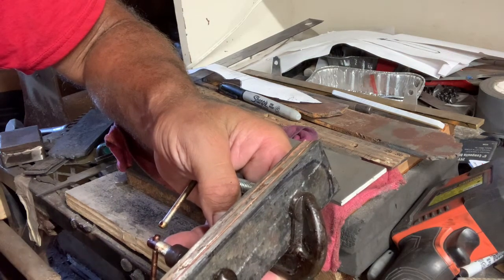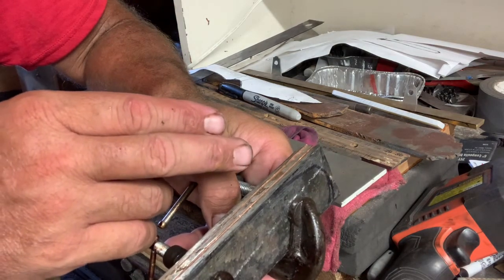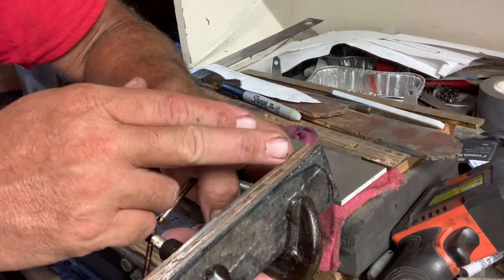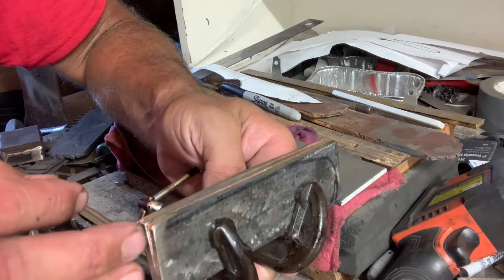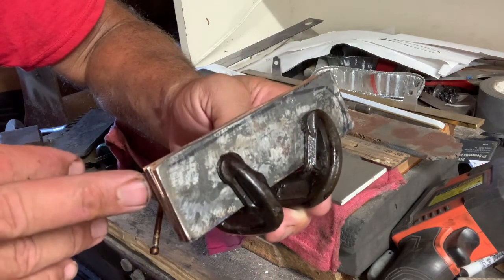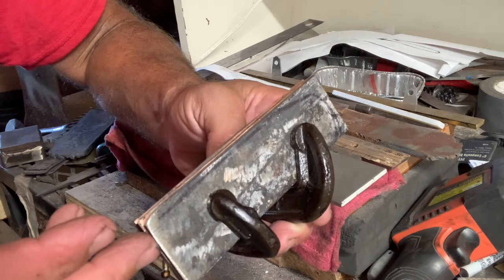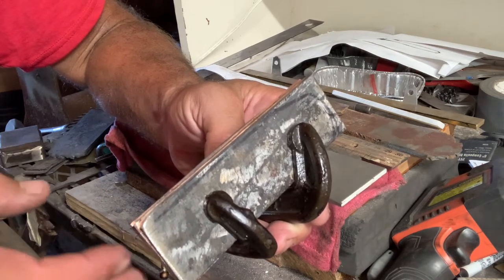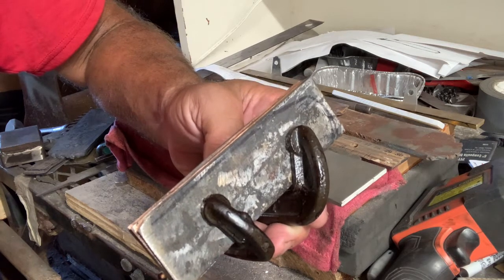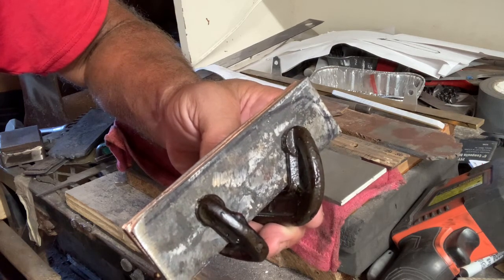A couple of videos showed they just didn't get it that hot. I don't weld really well with my MIG — I've had stainless San Mai that I couldn't get sealed and had to send to a better welder. So I'm thinking if I go ahead and weld this up, it may not work anyway. I hate to waste the Damascus, but I'm going to try to heat it up slowly, press it, heat it a little more, and just keep it around 1600 to 1700 degrees. My understanding is you get above 1900, that's when you get into trouble. I have no temperature control on my forge, so it's going to be by looking at it and guessing.